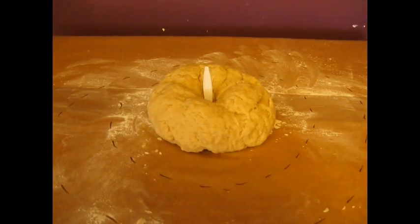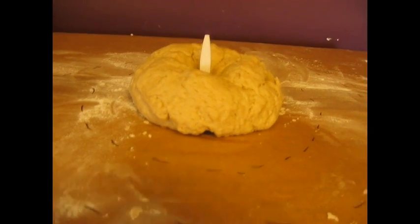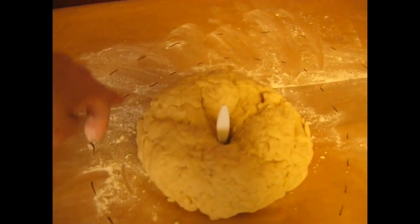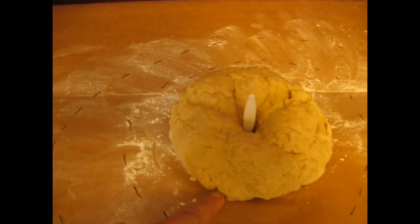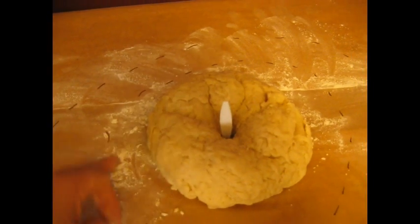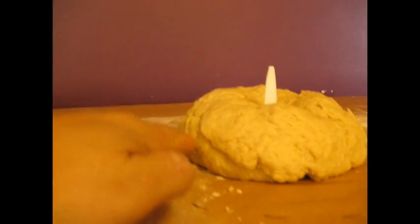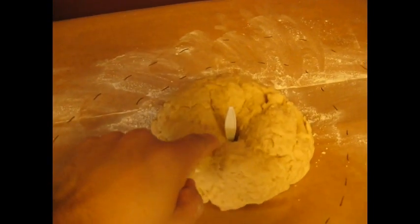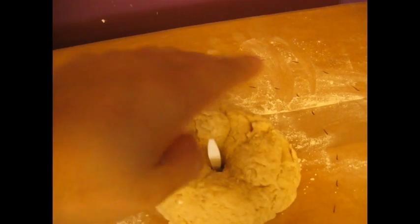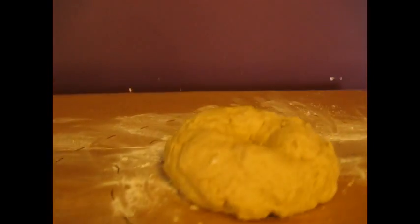Here's my representation of a quarter wavelength radiating antenna. As you can see, it's a circle — it's an omni-directional antenna, meaning that it radiates equally in all directions horizontally. The radiation pattern has a null in the middle because it doesn't radiate vertically at all, so it's more like a donut shape.